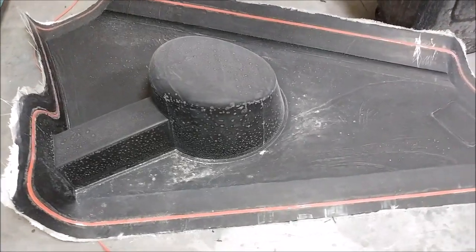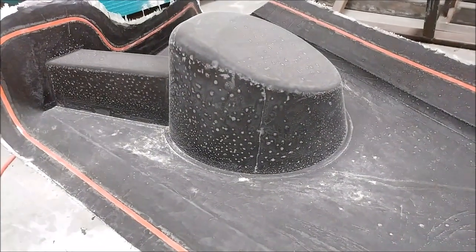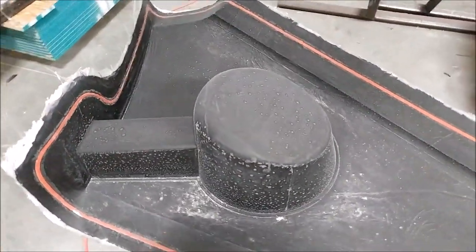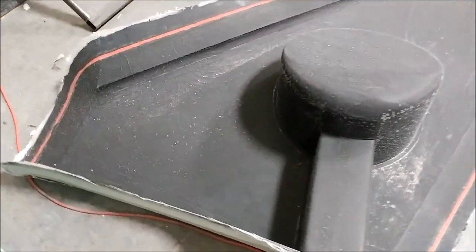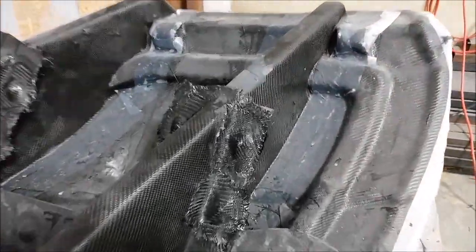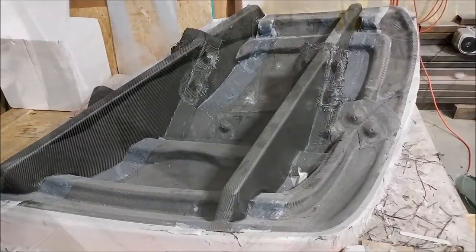This is the first of the wing strake molds released from the plug. It came out really nice — a little dusty, but it just needs to be cleaned up and braced. Three more to go: one more lower and two more uppers. We're officially making molds for the wings now. This is the last of the door frames — I put bushings on where those braces were and put some carbon over those yesterday, so it's getting very close to being ready to lay up that door frame, hopefully this week.